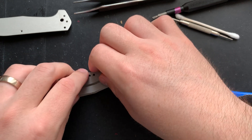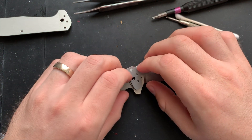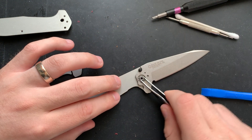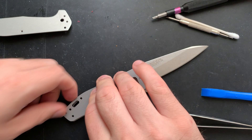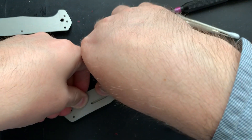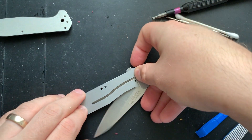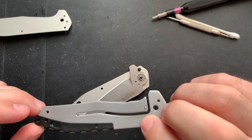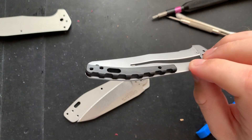There are locator pins on the backspacer that need to seat themselves. The stop pin needs to seat itself. I am rotating my pivot away from home. Are these popping into position? No, but that's probably because I have the blade deployed — when you have the blade out, it's very easy for things to be out of alignment. For some reason, I thought that there were locator pins on both sides of the backspacer, so of course it's not going to snap in because there's nothing to snap in.